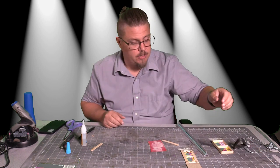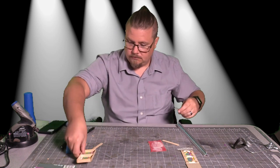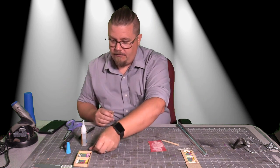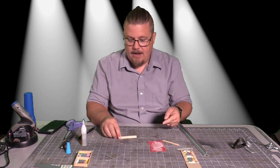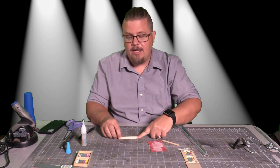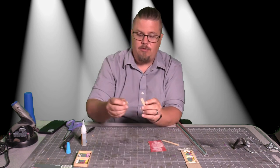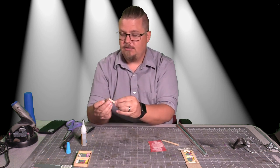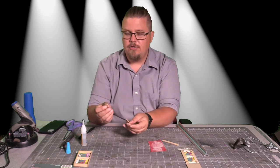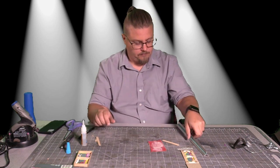The next flat we're going to be building today is our Hollywood flat. The Hollywood flat again has the pieces set up on edge, and they are nailed through the sides of the long piece. So if I have a piece like this and it connects to a piece like this, the nails get run through this edge into the other piece. And we usually use glue and staples to do that. So let's go ahead and build one of those.